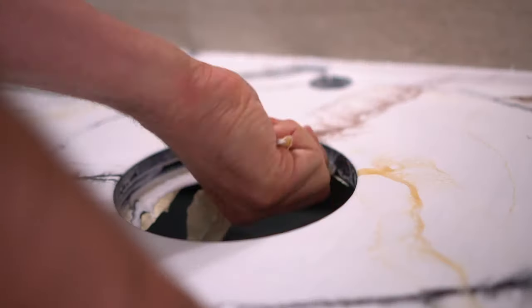If you want some extra durability, you can apply a second coat of clear epoxy — basically a flood coat that goes over the entire top surface, encapsulating the pigment you just poured. That's an option, and we'll see how this lasts in the meantime. I reinstall the cabinetry and sinks and apply some silicone to the outer edge. As a quick tip: after applying your silicone, use a spray bottle with just water and a bit of dawn dish soap — this makes smoothing out the silicone much easier. Then remove the tape and we are done!